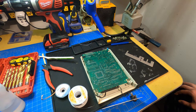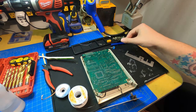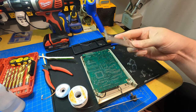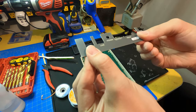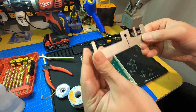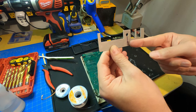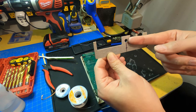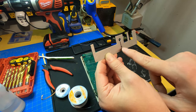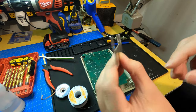So now the next thing is that I want to put this switch on the back and wire it to the speaker. I've already popped this back panel out here. This thing is really strange because it's definitely plastic here, but this side is metal. So I went ahead and Sharpied with a straight edge to get a line lined up with the power hole, and then just kind of eyeballed it, trying to get a good center. That bottom thicker line right there, that's the one I want to drill on, at that X right there.